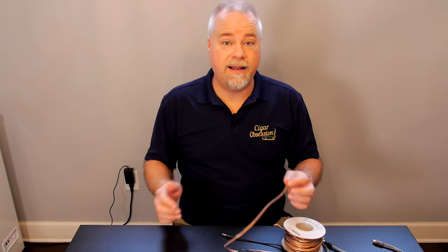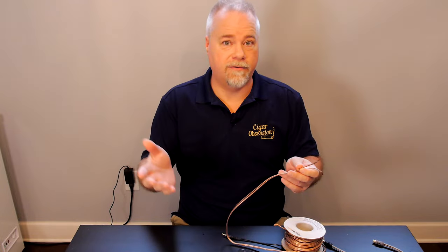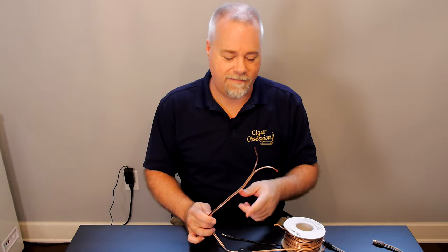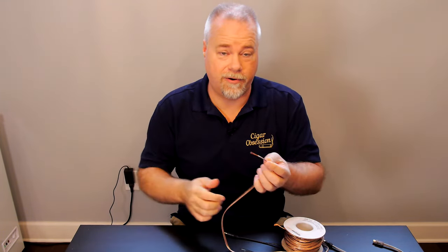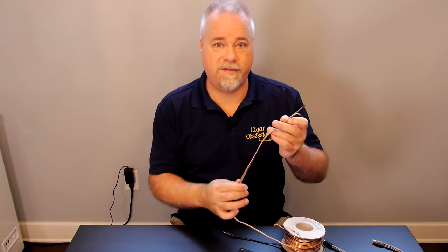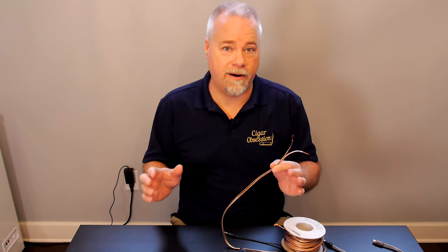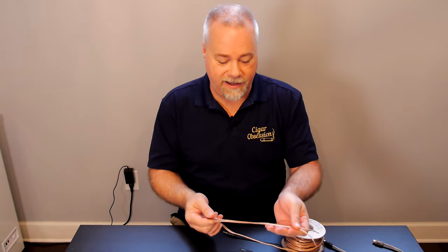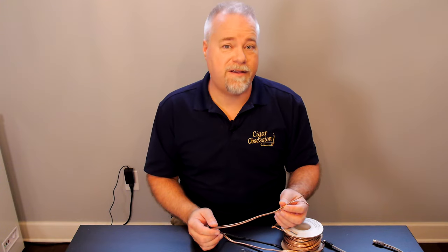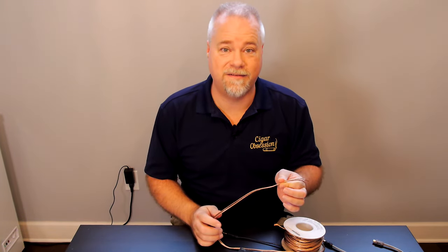In our homes these days, that can be anything that uses Wi-Fi, Bluetooth, smart home devices, your microwave — tons of stuff sends things through the air. Cell phones, cordless phones — the first generation of cordless phones were very interruptive. If you use speaker wire to go between your low-level source, like your processor or AVR, and an amplifier, that amplifier not only picks up the signal, it picks up the noise. It might manifest as static or pops, but most often it's hum. In a subwoofer especially, if you're picking up power wire noise — going through a wall, along a baseboard, or laying across other cables on the floor — you're going to hear right around 60 hertz, a constant hum that you're never going to get rid of. That's picking up the 60 Hz power wire hum, at least here in the United States.